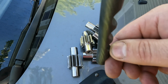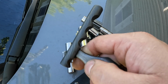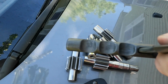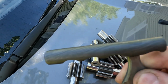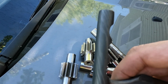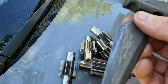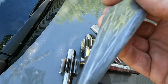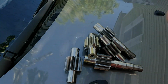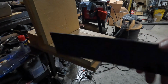But here's the handle after some etch. So you can see the helical striations here in this handle from the twist Damascus. I like how the pattern goes around, and then you look inside these finger grooves and the pattern kind of changes and there are small variations in it. I kind of like the randomness of it. And that's what I love about a lot of this knife making, especially Damascus. Sometimes you don't know what the exact pattern will etch. You have an idea, and the more you do it, you kind of build a mental history of what it will do.